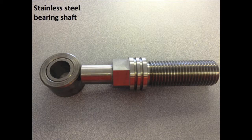The customer was using a two-part bushing assembly specifically to try to increase extended part life as much as possible. They were having premature failures with the bushing due to fusion welding because it was not lubricated. This application runs at higher temperature under load, continuously without lubrication, using similar 304 Series Stainless Steel. Thus the two-part bushing was an attempt by the original manufacturer to get longer life.